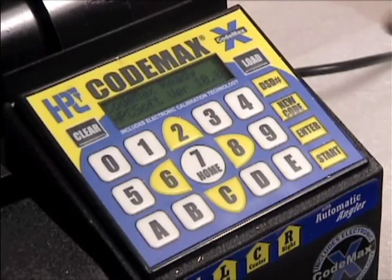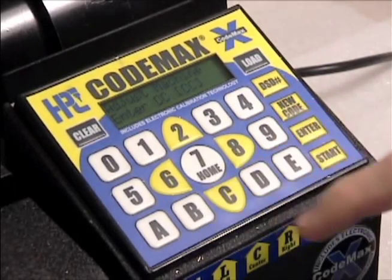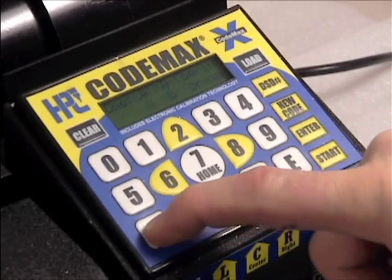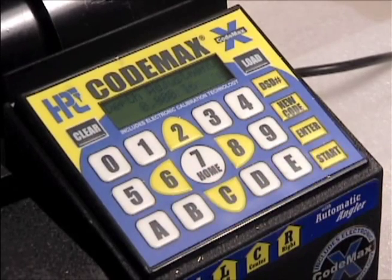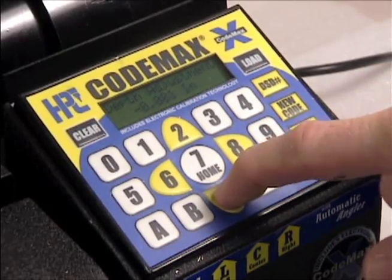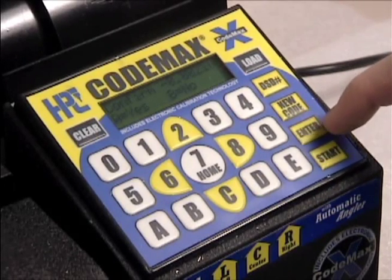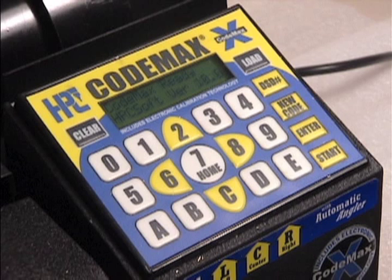Machine adjustments can be initiated by pressing the load button, then press C twice, followed by enter. Choose between inches and metric, then between spaces and depths. For depths, use the up arrow (2) or the down arrow (C) to change the depths. The display will show how much of an adjustment you are making. Press the enter button when you are done. Press A to confirm the adjustment or B to return to the depth adjustment screen.